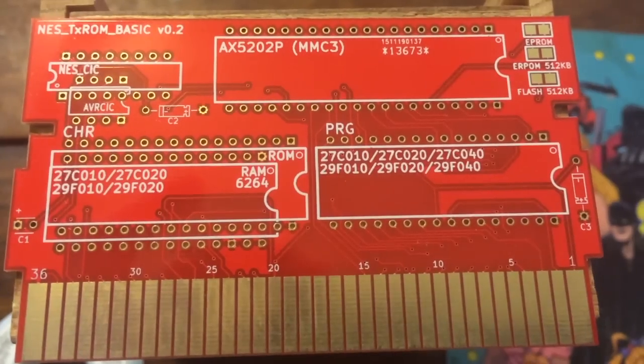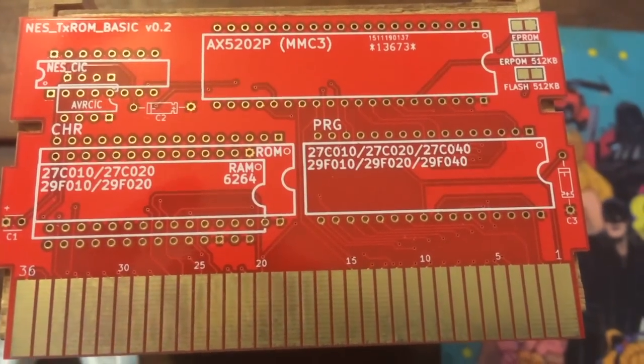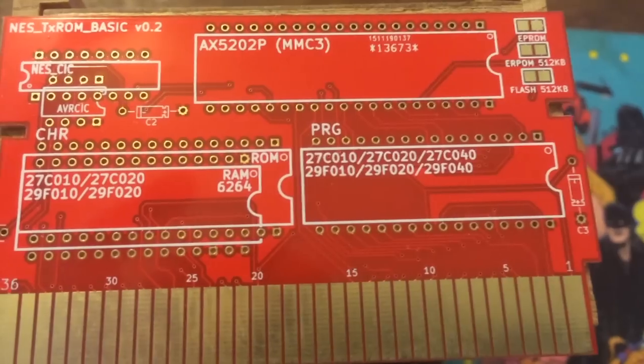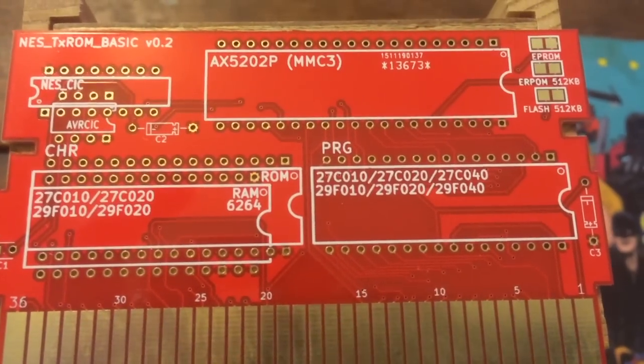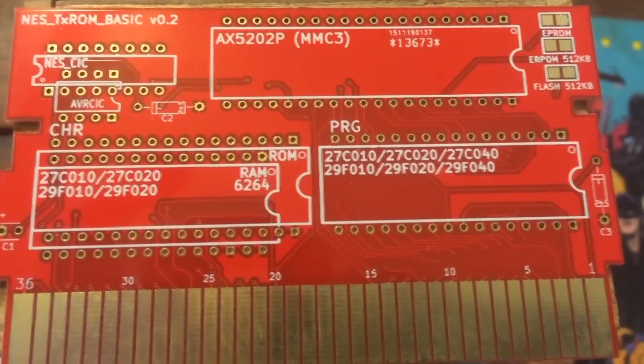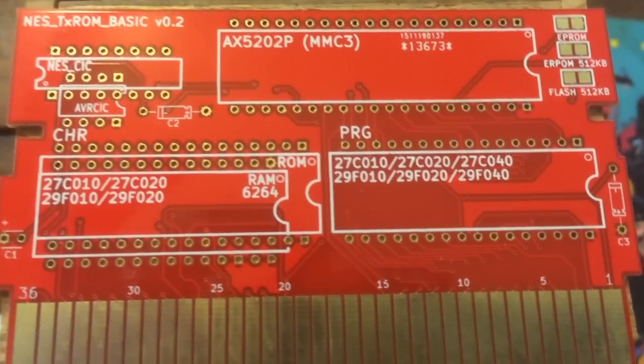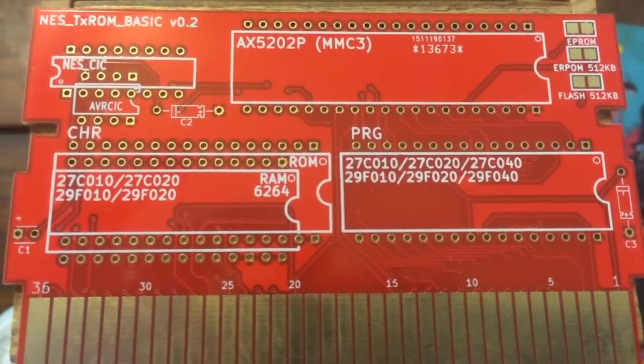Here we go. All right, time to give the TX ROM a chance here. This is for TS ROMs, TL ROMs. If you make repros yourself, man, these are the king of Nintendo games right here. All the best games, parallax scrolling and all that, are going to be using these kinds of chips. They also require 8 wires when you're making them yourself.